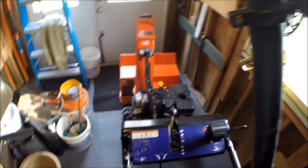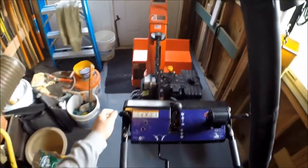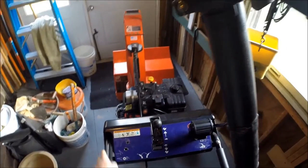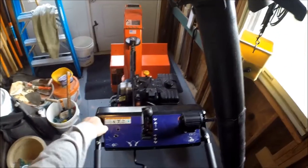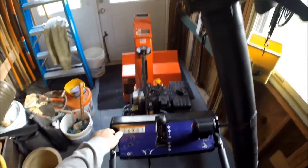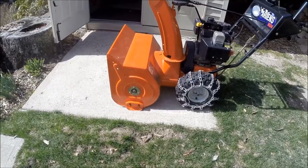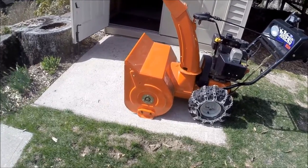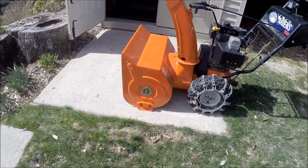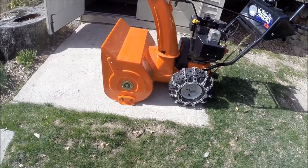Put it in a slower gear — you don't need to have it running fast or you'll be chasing the thing. Take smaller bites. If it starts bogging down, let up on the drive. Simple as that. You'll see in the video I'm going to link to this — you'll see me working it up and down. The snow blower should just move along on its own with the traction of the rear wheels and really should not ride up. So if it's riding up, you have one of those two things that are probably the cause.